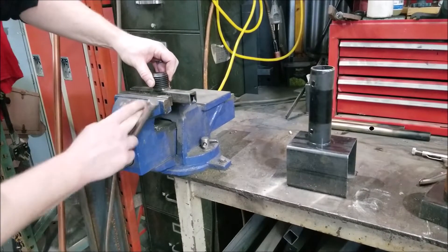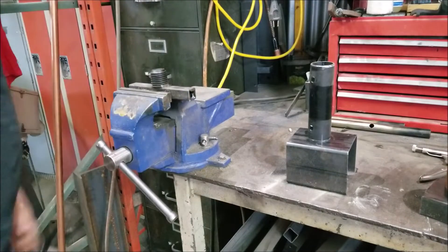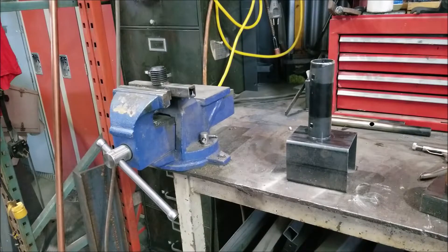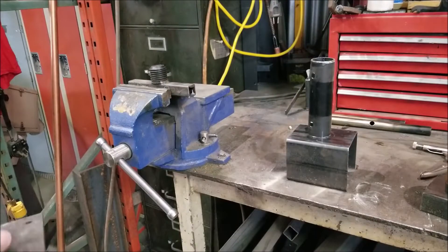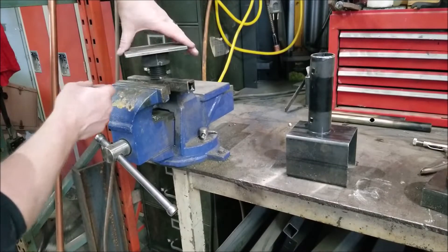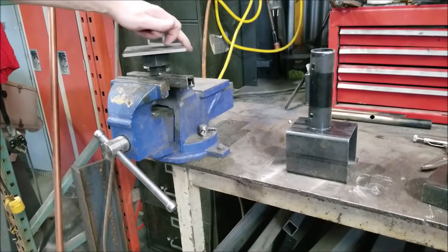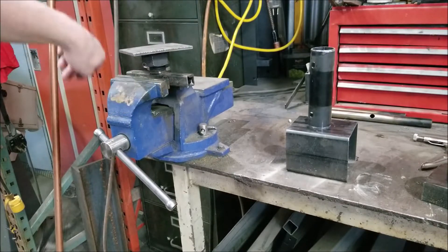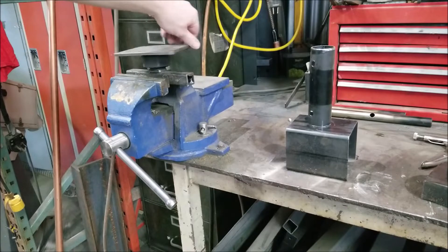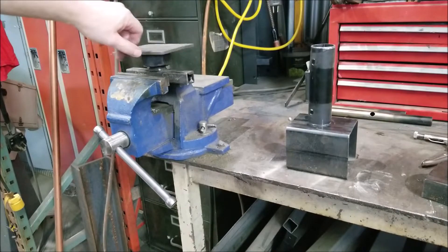The square tubing fits nicely — make it nice and tight. It also gives you somewhere to put your ground clamp, and because of thread pitch there's a lot of contact area, so the ground still works through this movable thread here. I've never had any problems with the ground.